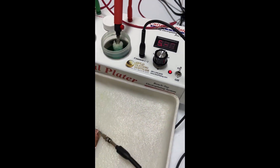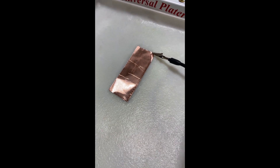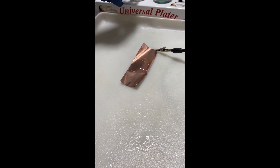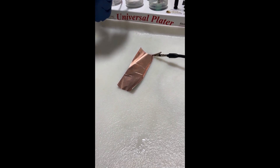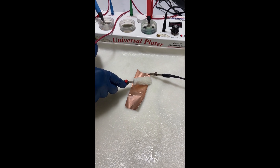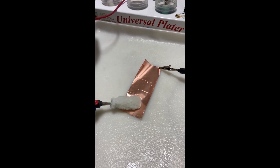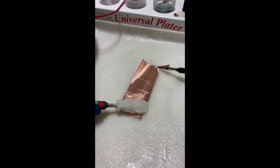That's really long enough for the ElectraClean of that copper foil. We've ElectraCleaned, and you can see that the paper behind is kind of curling a little bit. However, normally that doesn't have any effect on the adhesive properties. So the next thing we're going to do is activate the surface of the copper with Surface Activator. We'll be using about the same voltage, and we just want to make sure we go over the entire thing at least once — I'm going to go over it twice. But it's really about that quick.